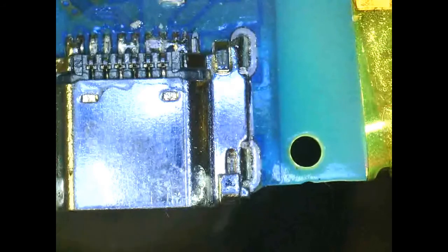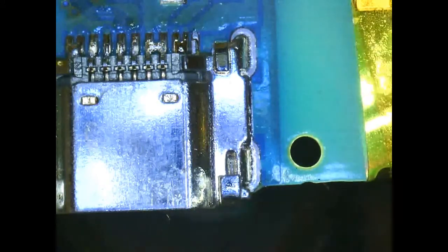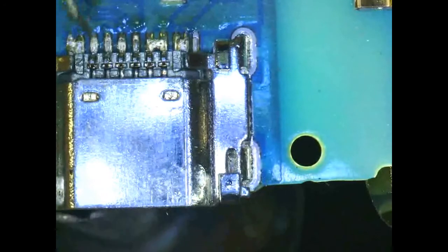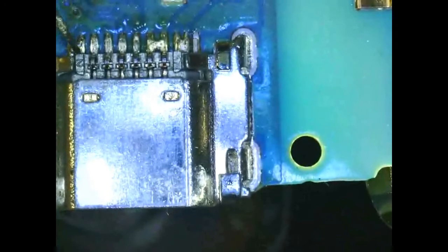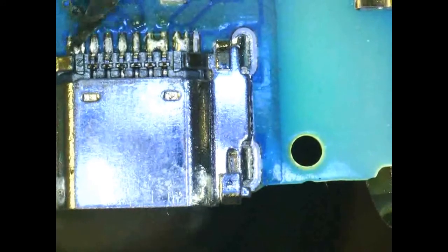Because the pins are so close together, using a soldering iron is not very efficient, especially because directly behind that charging port there are a lot of components that make it difficult to get in there. Using the X-Acto knife very gently — or some kind of thin blade — allows you to get some of that excess solder out. Because the blade is cool and the solder is hot, it'll somewhat cool the solder and allow it to stick to the end of the blade, and you can see it come off the board. Every time you get solder on the X-Acto blade, wipe it off before going again; otherwise the solder will just go right back on the pins.